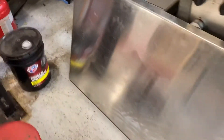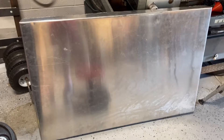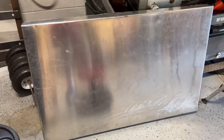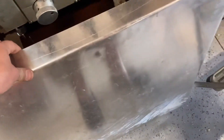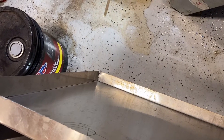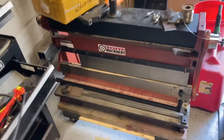The water table didn't come out as well as I was hoping. It's 48 inches by 38 inches — actually 38 by 30 is the actual interior dimension. This is aluminum I had laying around, I think it's 35 thousandths. The bends didn't come out great. I'm probably going to TIG it — I'm not great at TIG welding thin aluminum like that, but I'm going to give it a shot. If not, I'll come up with something else to seal those corners. I have one of those Harbor Freight finger brakes with the shear and slip roller, but that only accepts up to a 30-inch width, so that obviously wasn't going to work.